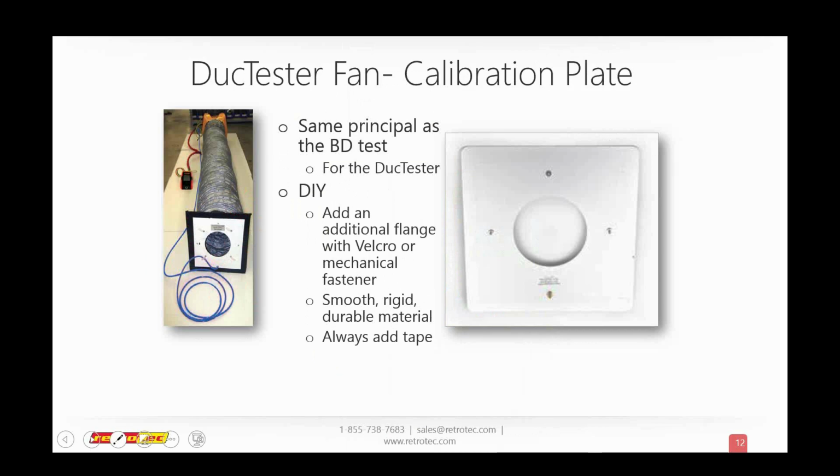And I don't know whether you mentioned or not, Jay, but we can actually measure these holes in equivalent leakage area, so we can measure them directly. We don't have to measure them in CFM. I personally think that CFM at 50 or CFM at 25 are silly units. I think that a hole size and area is a much smarter unit because it's something you can actually see. Like that hole there, I think is 18.6 square inches. Well, you can understand that. But 129 CFM at 40 pascals, how big a hole is that? Who knows? Back to you, Jay.